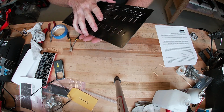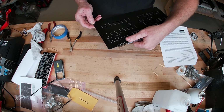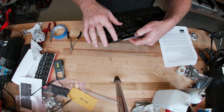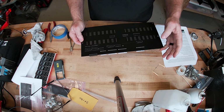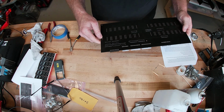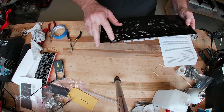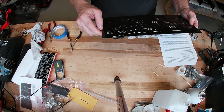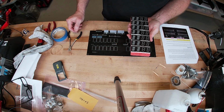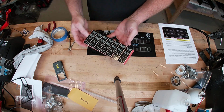All right, I'll clean that connection up and we'll keep going. All right, that connection's all cleaned up, and one of the things you can do, and I do this quite a bit too, is use rubbing alcohol, and then no matter what I do, I use compressed air once I'm cleaning it. It gets the board dry so I can continue working. It's a little bit more important on these ribbon cables, because the solder joints are so close together, you'll make sure you didn't bridge a joint or something, so you always want to look at everything really good. We have 7-segment and 14-segment LEDs.